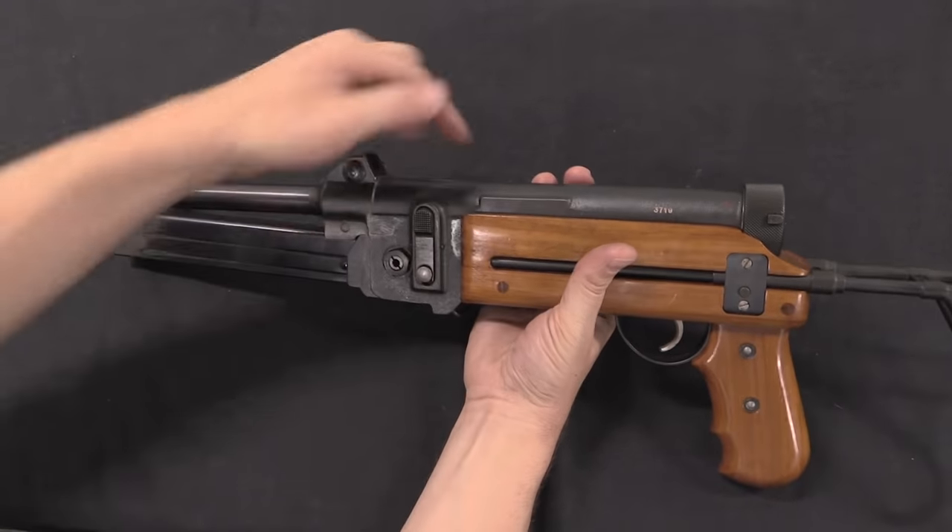So to take this off I just depress that, rotate it so the arrows line up with each other, and then this comes off. One of the nice improvements they made here is a fully captive recoil spring, which takes a lot of the hassle out of reassembling a gun with a loose recoil spring. The bolt handle has been slightly redesigned but works essentially the same way — there's a round cutout there for the front end of that captive recoil spring, which ensures the bolt handle can't come out. The bolt has been simplified a bit with fewer machine cuts necessary. You may notice this looks quite a lot like something like a Sten bolt. The firing pin is fixed in here — it's actually still a separate piece that's just pressed in place. On the earlier guns, going back to the MKM and MKP series, the firing pin was actually a separate component that would come out.